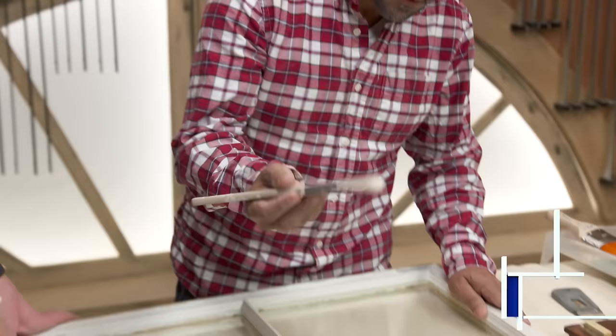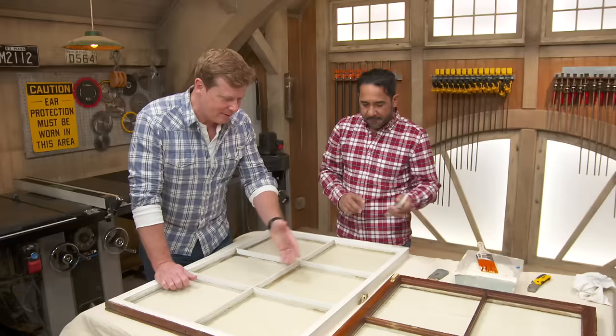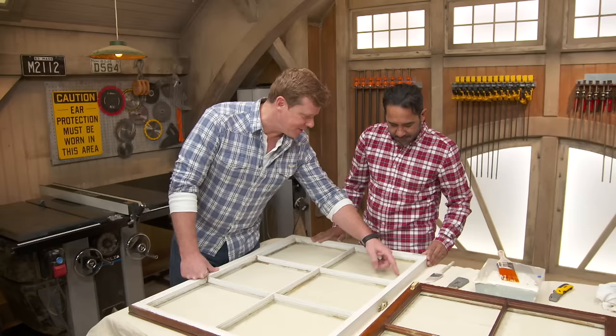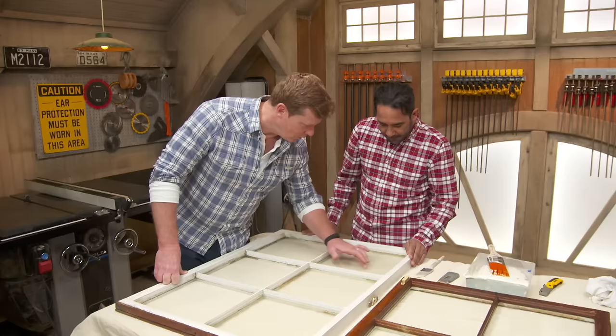Of course, if you've got a steady hand like a pro, it's not that bad. There are two ways to do it. You could go with a small brush cutting around the glass pieces. Or you could blue tape everything — masking — but it takes a lot of time, and you don't want to go that way. It's not always that effective. Look at this: we've got six panes here. If this was a double-hung window, you'd have 12 in total. You could spend forever masking around, and sometimes the paint drips underneath the tape — it goes right under the tape. It's not easy.